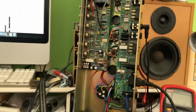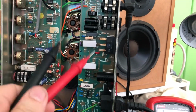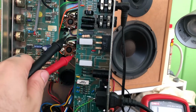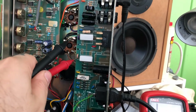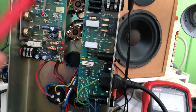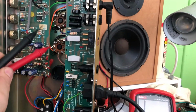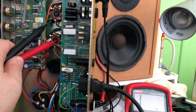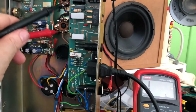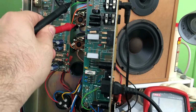put it back. Although having said that, when I look at the wiring here as well, notice that this resistor, according to the schematic, should be wired in here, PK1, and there are no wires here. Do you see this pink wire, PK2? This pink wire is the one that's actually connected, and it looks like it's going to that other pink wire here, which is our bias supply, I believe. Pin 5, let's have a look. 1, 2, 3, 4, oh no, pin 5's here. Pin 4, so that would be a grid. And then the purple wire here is also going to pin 4, so that's okay.